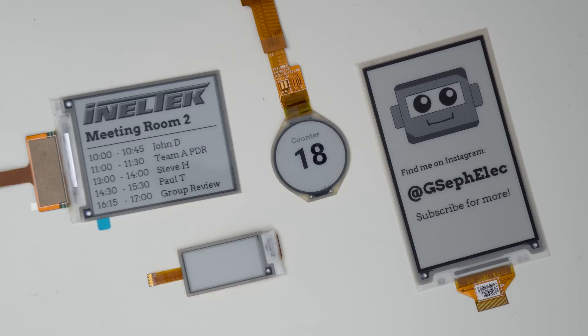It's update quality versus update speed. Since this 1.1 inch display is designed for smartwatches, being able to perform partial updates is vital — especially if you plan to change the time display every minute, you want to do this as discreetly as possible rather than flashing black and white a few times and continually drawing the user's attention. Unlike the simple all-in-one displays, because of the fast update times and grayscale capabilities, these displays are typically aimed at applications that respond to user input.